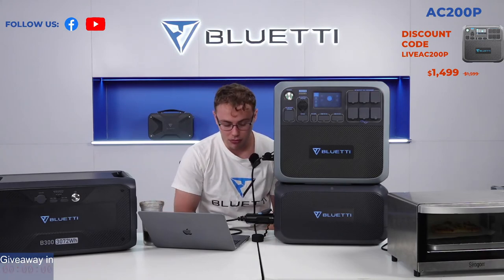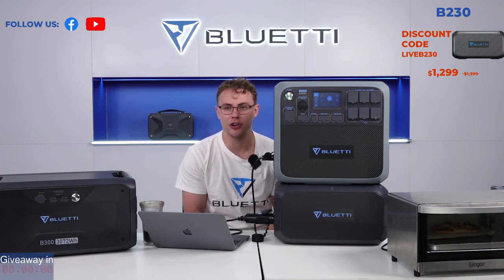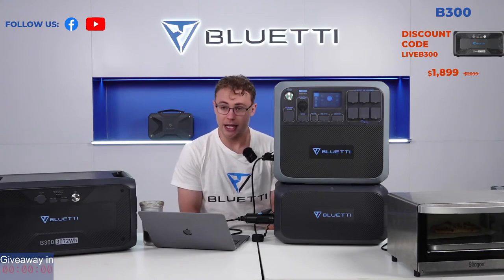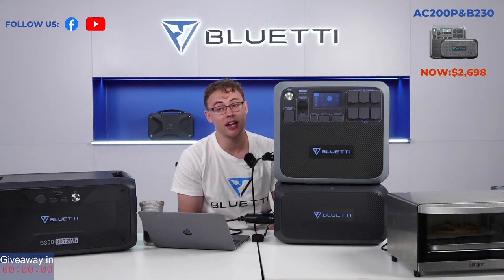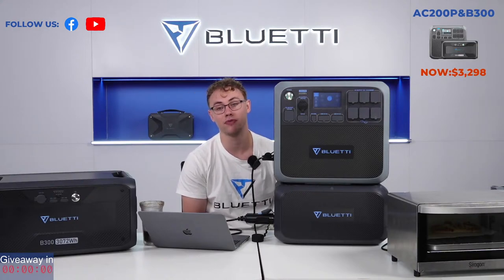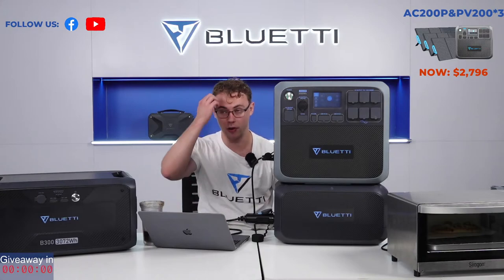If you're charging it from a car power socket, it can be either 12 or 24 volts, but you have to do this with the D050S, which is a DC charging enhancer. Another method is from a lead acid battery, 12 or 24 volts, both fine. The maximum input is 500 watts. Again, you have to have a DC charging enhancer, the D050S.